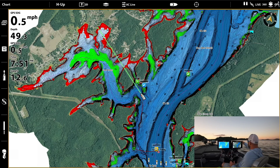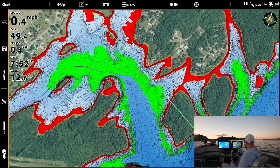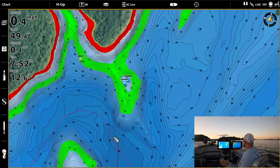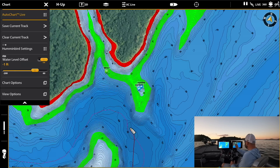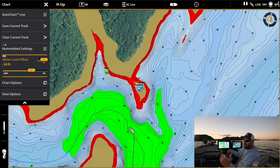Now when I pull up to a main lake point I can see my depth highlight range right there. For safety — and for water level offset on the TVA, where there's a lot of fluctuation — you can drop the water level on the map. On western highland reservoirs they sometimes pull down 100 to 200 feet. The easiest way to check: when you launch, if your map says 10 feet but it should be 20, go negative 10 feet. Just cross-reference your actual depth with what the map is showing.